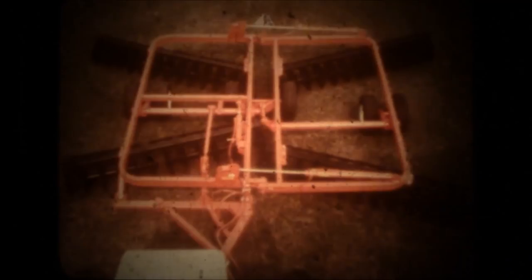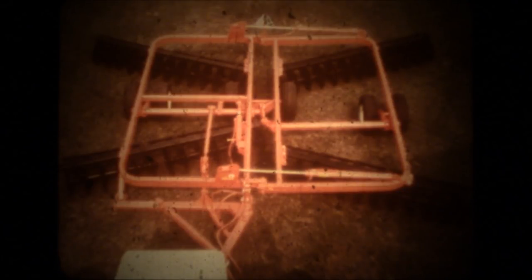The wing cross shaft connects to the main cross shaft through a turnbuckle arrangement that results in a level relationship between the two frame modules. Spring-cushioned parallel lift linkage levels the harrow fore and aft in transport position and keeps most of the weight over the blades for effective penetration. The spring collars compress to automatically fine-tune leveling while disking on rolling fields and for protection against hidden shocks.